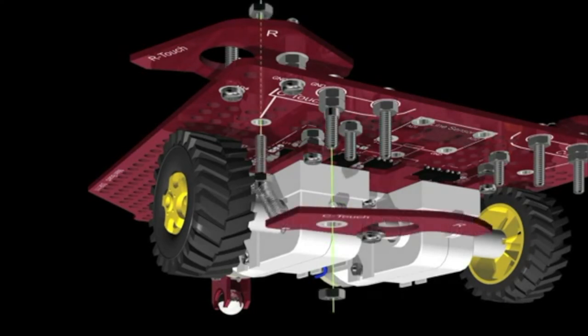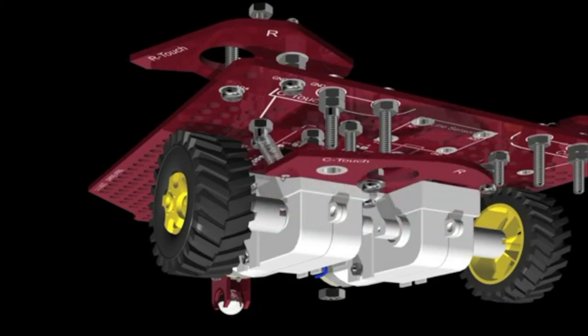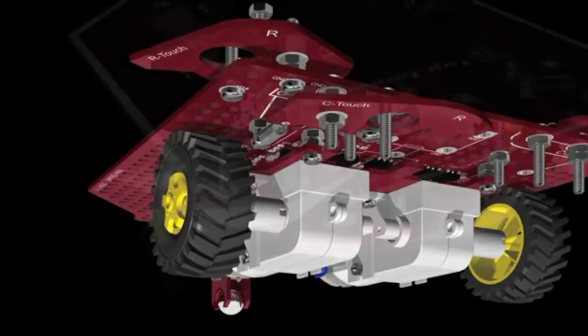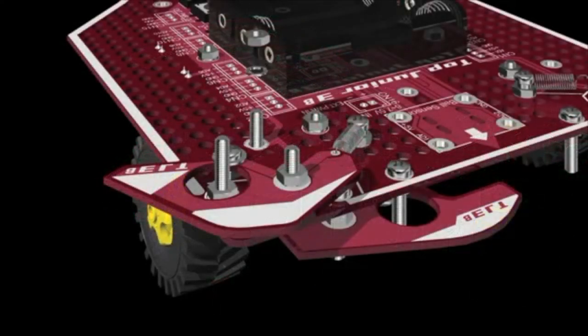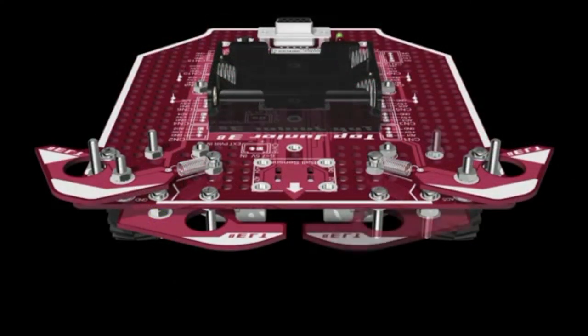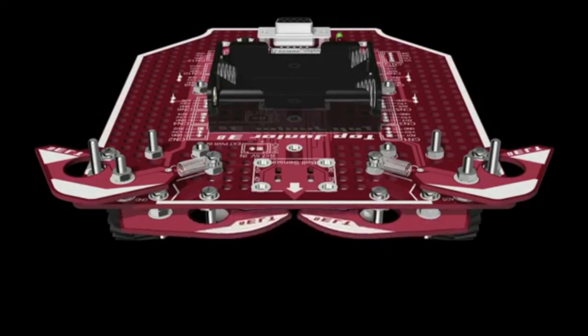Insert the screw attached to the spring into the main board from the lower side. Then insert the board onto the rotation axis screw and secure it with a nut. Secure the screw attached to the spring with a washer and nut as well. Do the same for the second central touch sensor. Once finished, test the movement of the sensors.